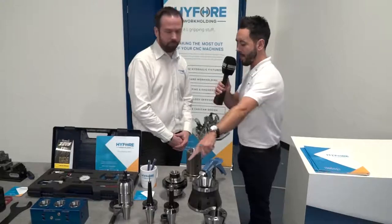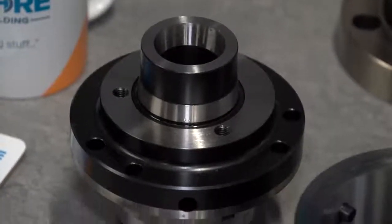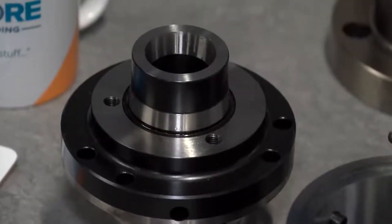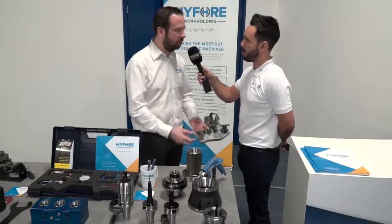And what is this? This is a new product from Hardinge. With our 65 collet chucks, if a customer's a big user of 5C collets for example, we've got these adapters that he can use in his Flexi collet chucks to be able to use the 5C collets and also step chucks and mandrels.